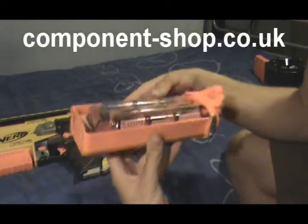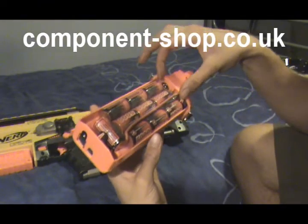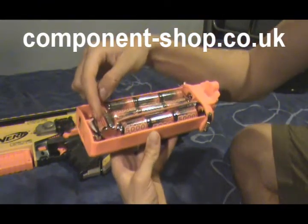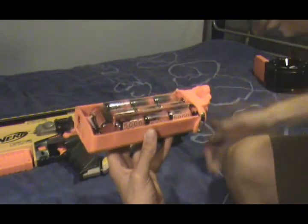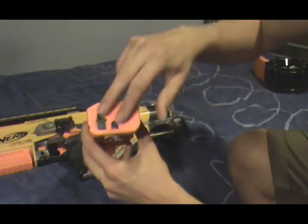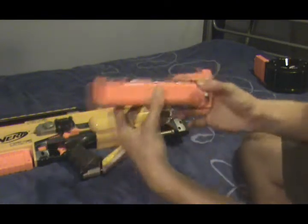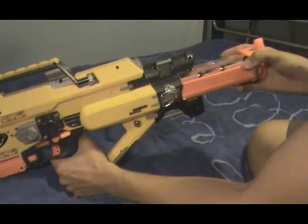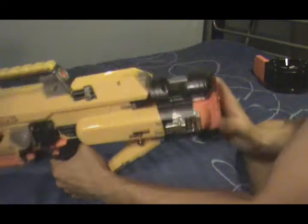I got that made to 12 volts, 5000 milliamp hours, and I had it made to the exact specifications, the dimensions of the tray after I'd removed the spacers, so it'd fit in this width and that length between the two plastic tabs. And then soldered the connectors onto the springs, and using standard push connector terminals so that it just fits in a normal gun. No need to solder any packs on or off. And that's pretty much it.